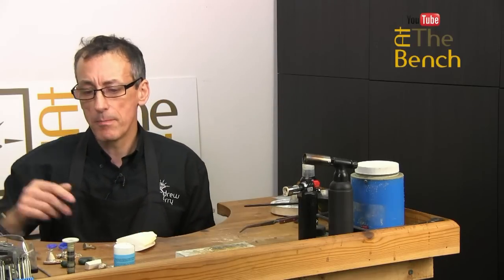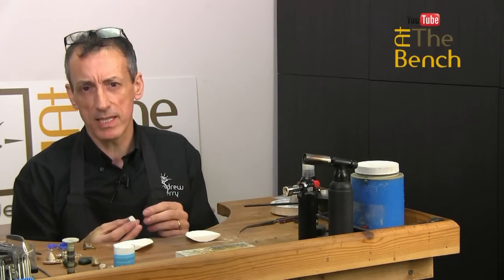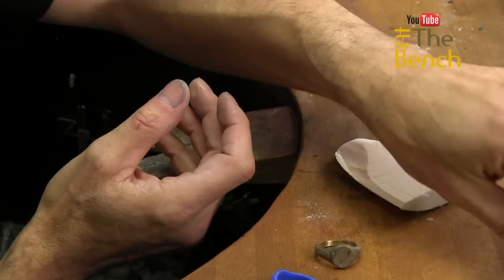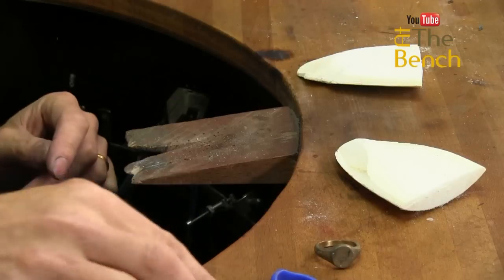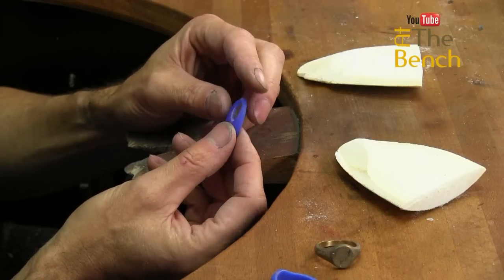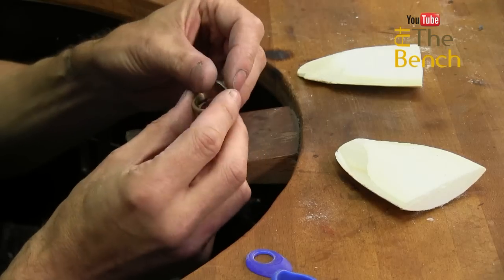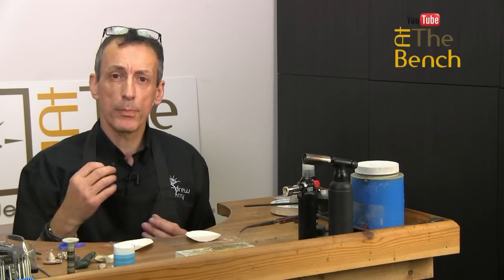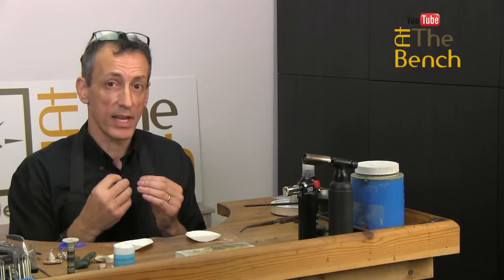There are several ways you can make use of cuttlefish — we've made ingots, little ingot shapes almost like a chunk of chocolate. You can carve out of Delft clay or wax, nice bulbous hearts as we've got here. You can even use ready-made rings and cast them in cuttlefish. As I said, the finish is quite rough — if you want a perfectly smooth, mirror-like finish, you're going to have to do quite a bit of filing. But this is a brilliant technique to use that texture.